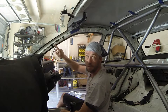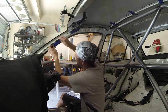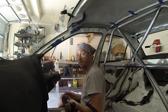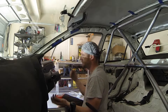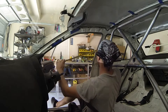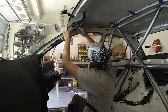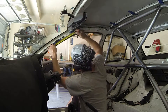I recall where that first two-foot mark was, and somewhere about 12 inches away I'm going to put another piece of tape, because half of six feet is three feet or 36 inches. It's a lot easier to work from the center of the tube outward to get your bends, at least where you only have two separate bends. So I'm going to give just a little bit of excess and start on the outside of the main hoop at a 24-inch mark, and we're going to add 12 inches to it.